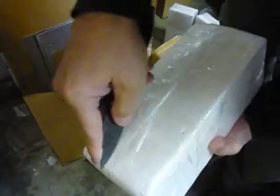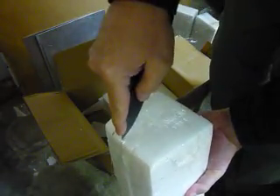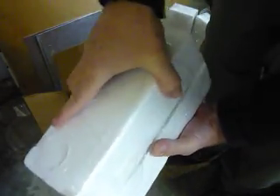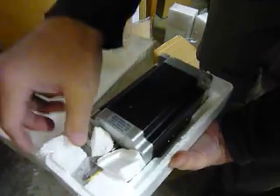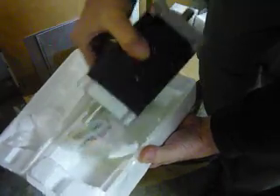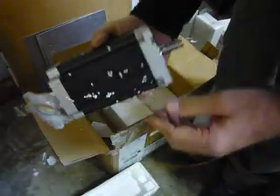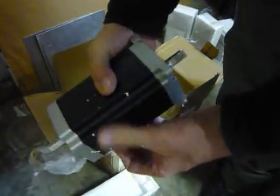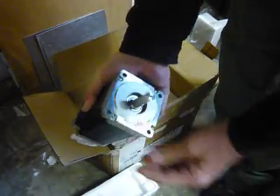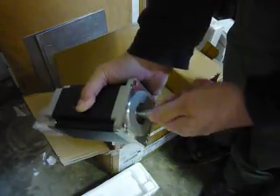It's about a two-horsepower machine — I'm probably going to drop it back to one and a half horsepower three-phase so I can put a VFD on the spindle and control the spindle speed. It's just a little benchtop milling machine, but this should be pretty beefy for that — I've seen people driving these things with motors half or even almost a third this size. A little nastiness from the styrofoam which I hate, but it's nicely protected which I love. Very nice looking stepper motors. My impression so far is pretty good.